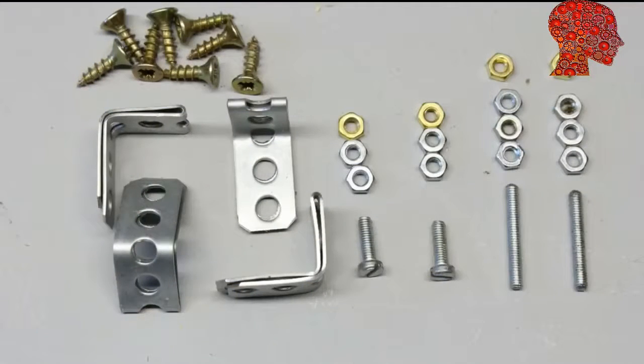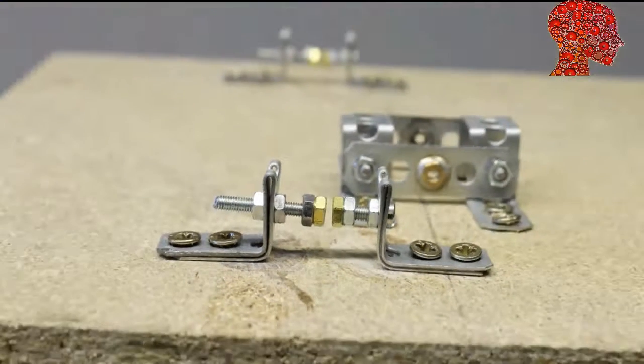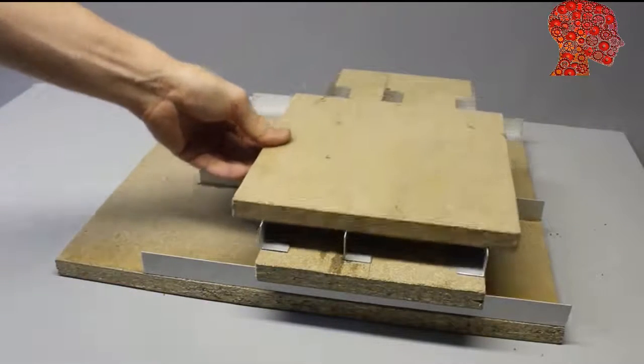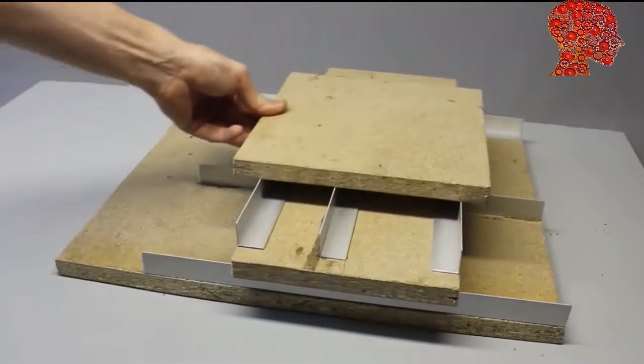The axes are guided by the middle aluminum bar using perforated metal stripes as well as 3mm screws and nuts. Once again I am using brass nuts at the ends of the screws to reduce abrasion of the aluminum angles. Same as with the threaded bars, the adjustment is a compromise between low clearance and friction. The mechanism for the Y-axis is built in the same way. Both axes can process linear movement.